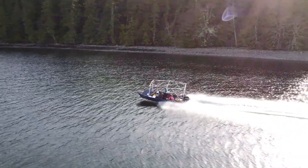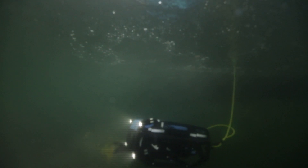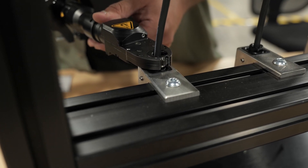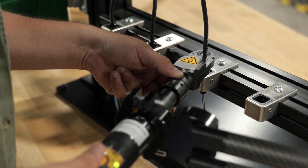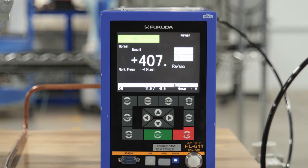In addition to that, we did hundreds of hours of field testing with WetLink penetrator-equipped ROVs, pushing them well past our normal limits. We also stepped up our production capabilities, adding new tools and inline test equipment to ensure that every WetLink penetrator that we use in our products is assembled to high standards. Each penetrator is subjected to a high-pressure leak test on the production line so that every single unit has been tested before you receive it. Because of all that, we have a design that we're extremely confident in and proud of. It'll become a cornerstone of our WetLink product family and a key component in most of our Blue Robotics products.